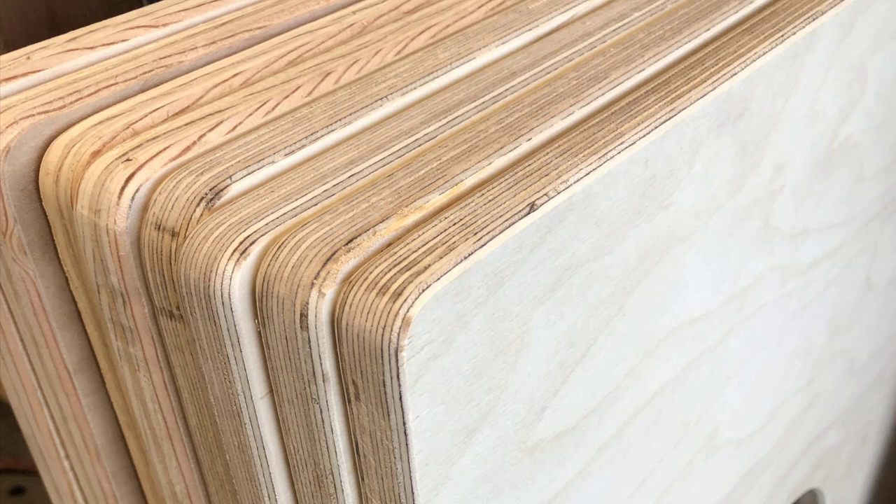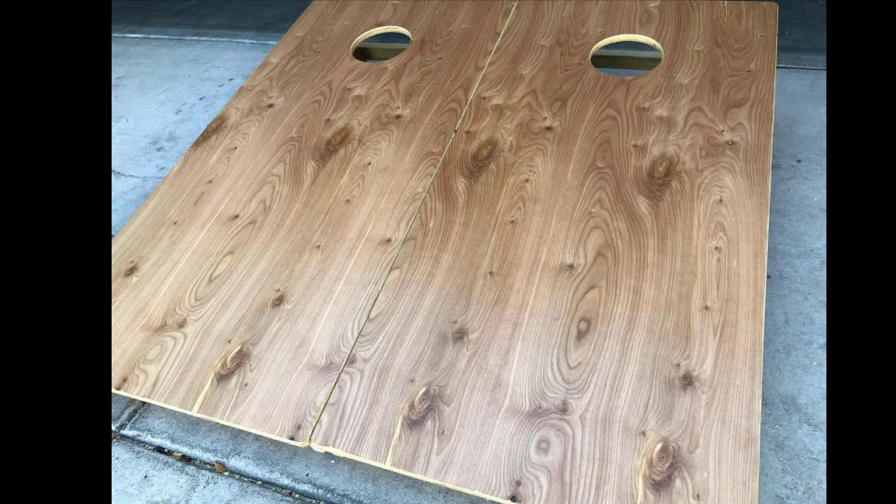The only other steps are to sand the surface — I would use 320-grit paper if they're already pretty smooth. Make sure you check all your edges and sand those a bit. If you have any little voids that need to be filled, use some wood filler and sand those down when they're dry. Now you've got all your decks lined up looking pretty. Stack those flat to make sure they don't curve over time until you start using them. I'll talk to you when it's time for the next step — have a good day.